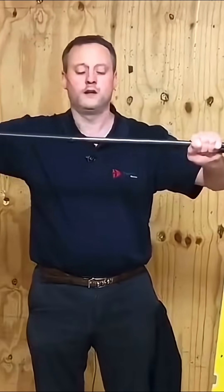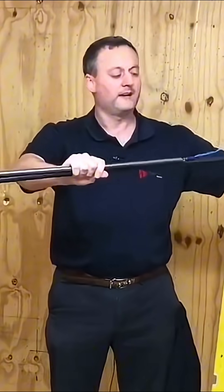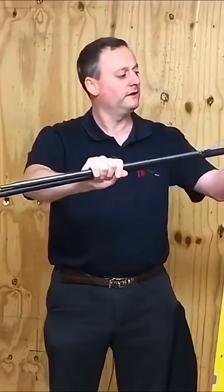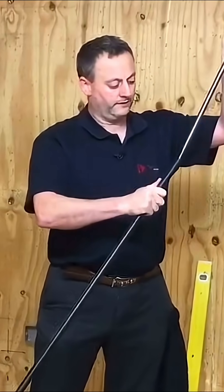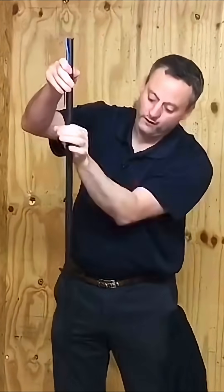The spring needs to be offered up on the outside first to work out where you want to start the bend — slightly more to this end for me, so this side will be longer. There's a cable on the outside to prevent getting trapped inside the conduit; just fold it over so I can drop it into the conduit itself and position it down.